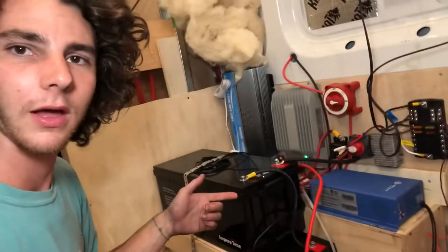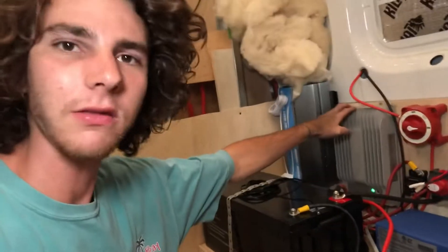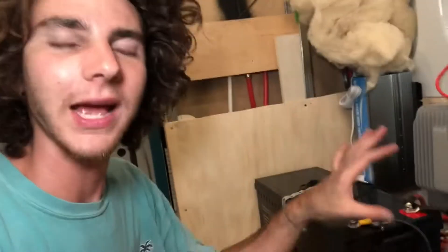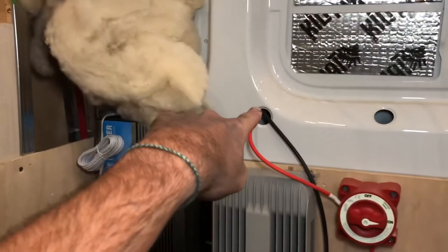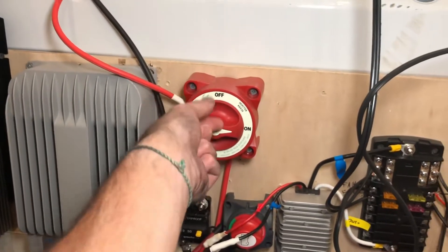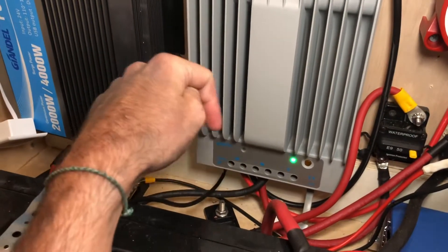Because it is 24 volts, I have a lot of solar coming into a not-so-big charge controller, whereas in a 12-volt system I probably would have needed two of them — so that's a plus. The only thing charging my batteries right now is solar coming in from the top. As you can see in my 800 watts of solar install video, I've got 24 volts of solar coming down into my 24-volt system, going into a main shutoff valve, which is connected to the positive and going into my charge controller, which is connected to the batteries.